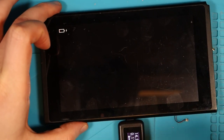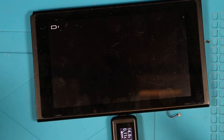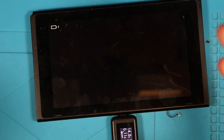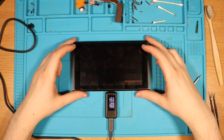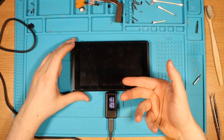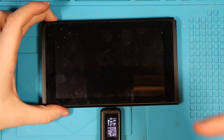We're right back to the start — it says 0.00. Then 0.07... oh, no way — it's charging now! So it's not going to turn on because I'm guessing the battery is that flat — that's why 0.11 amps. I'm going to leave this to charge for five minutes and see what happens. Moment of truth. We've gone up to 0.67 amps, which shows it's charging. I'm pretty sure that's fast charging as well.